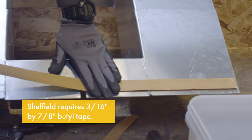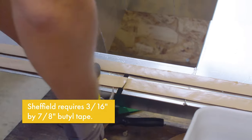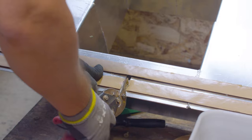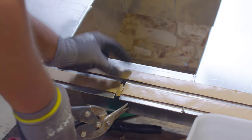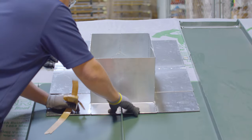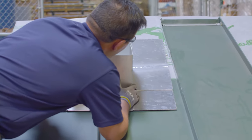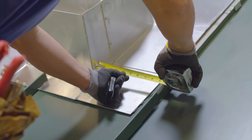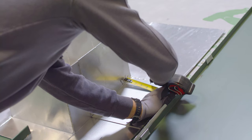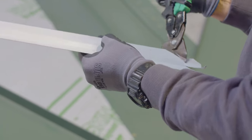Keep in mind that this is the architectural curb — generally there's a structural curb already set in place. Structural curbs can be made of steel or wood. The steel structural curbs need to be separated from the aluminum curbs provided by RPI due to galvanic reaction from dissimilar metals. Once the curb is notched and in place, install the offset cleat around the perimeter, maintaining a minimum 4-inch space for water runoff.